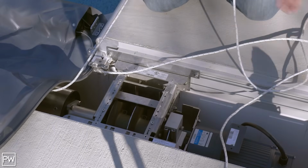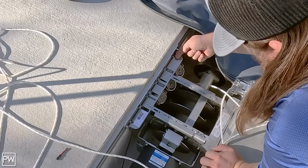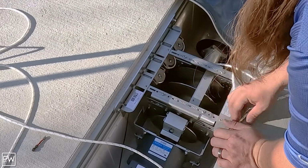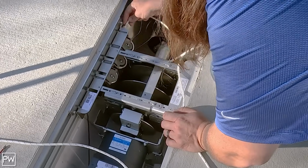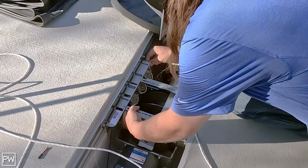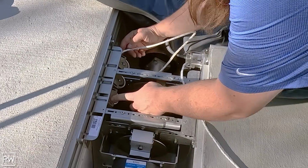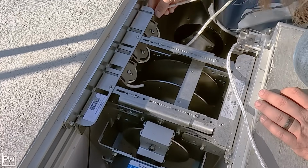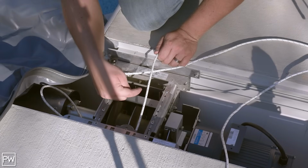So we're gonna start with our far side rope first. This rope is gonna go through the end, here, through the end, behind both of these first 2 pulleys, and then through the 3rd pulley. Sometimes we need to use a small flathead to use this little pulley window here to help encourage the rope through. I'm gonna put my finger over here, help myself catch it when it gets there. Push it down. We can see, do you see this rope coming through there, that pulley window? I was able to stick my finger in and push it down. So when I push on that rope, right there.